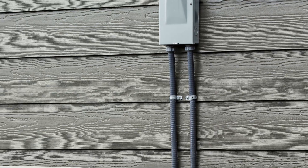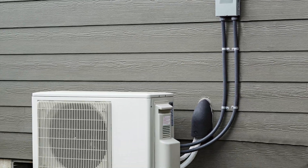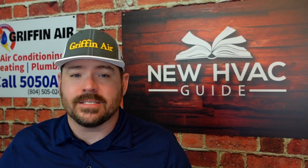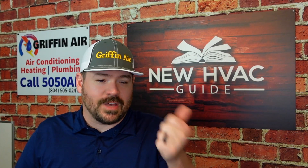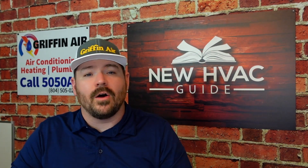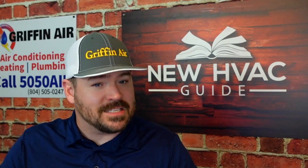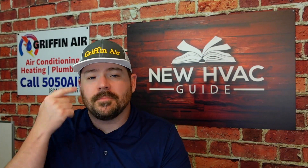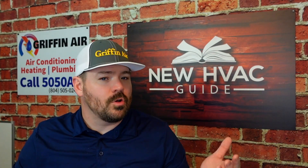Next, let's talk about electric. You've got to get electric to these units somehow. With most mini splits, you're going to run your line voltage wiring from the panel — usually an electrician installs that. It goes to the outdoor unit, and then the communication wire powers the indoor unit. In some cases though, such as with VRV or VRF systems, you've also got to get power to the indoor unit. You've got to physically figure out how you're going to get power from one to the other. You may not necessarily have to figure that out — maybe your electrician does — but it's something to be mindful of when selecting the location.